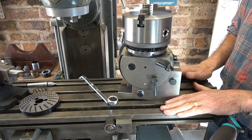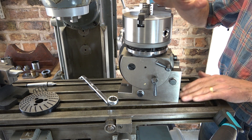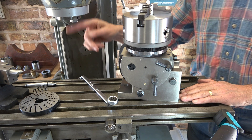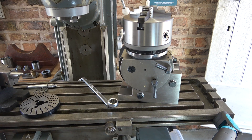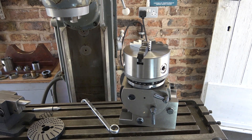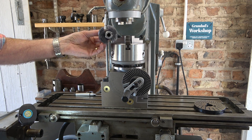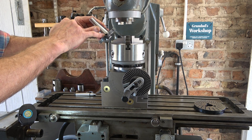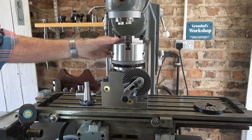I'm going to drop the table and see if I could use this vertically on this mill. Even though it's nice and small I think it might still be a bit too tall - probably not enough clearance between the cutter and the table. But you can see with the table fully down, using a low-profile adapter holder I'd be able to put a cutter in and it would just sit above. I wouldn't have wanted a dividing head any bigger on this mill - I think it's just the perfect size.